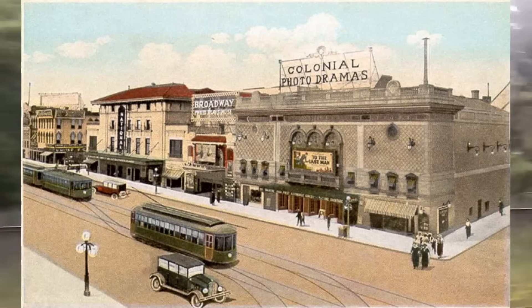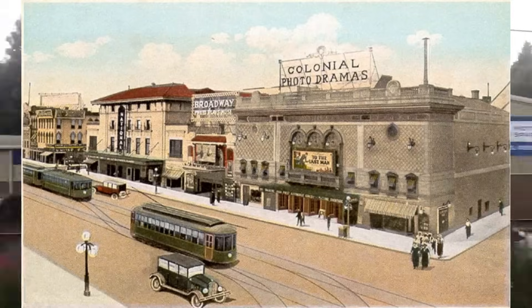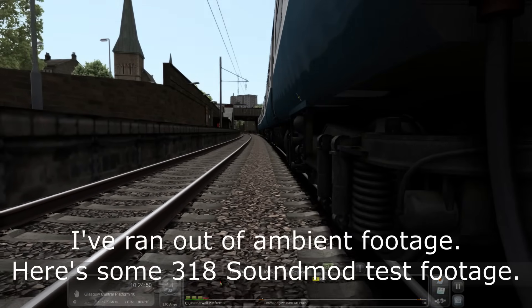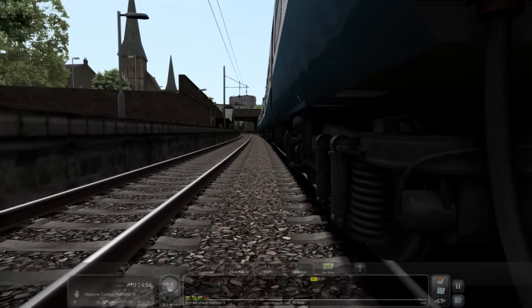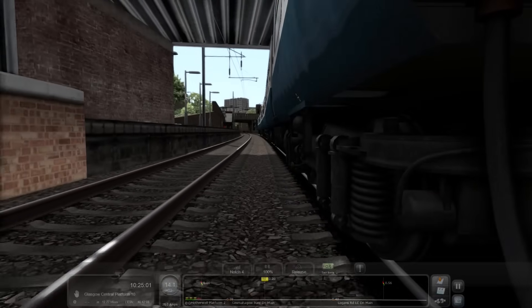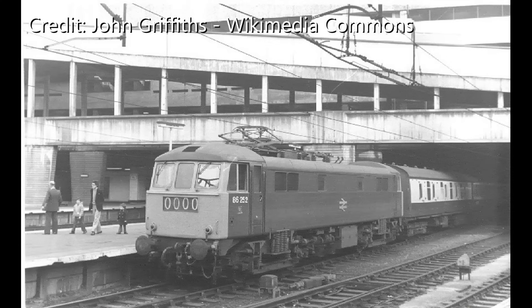This technology was applied to new tram cars produced for the new tram lines in the streets of Richmond, Virginia in the United States, which had to contend with gradients of up to 10%. This system was revolutionary, as it provided the supply of electricity through trolley poles, which Sprague devised five years earlier, as well as regenerative braking to feed power generated from the traction motors back to the overhead DC supply system. It proved the success of Sprague's new motor mounting method, which had come to be known as the suspended drive method.